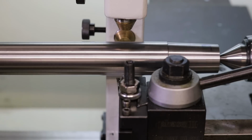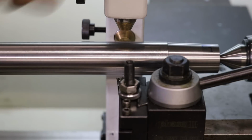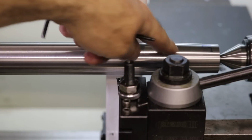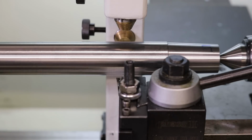But as you saw, our shaft is already out of round, and typically if you need to use a follow rest, you're going to start with stock that is not perfectly round anyway. Since we're trying to squeeze out every micron, we're going to have to start and stop on the new piece of stock. This is the scrap piece with the CNC profile in the end. So we'll start the cut and then stop the cut so we can set our feet onto the area that's going to have a post operation, the CNC taper, and then continue the cut all the way across to see if we can help support the end of the shaft so we don't get that plus or minus 15 micron runout. All right, so let's go ahead and set up for that.